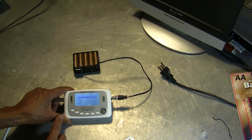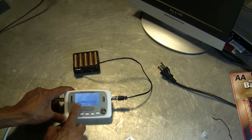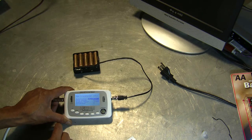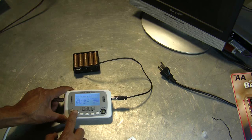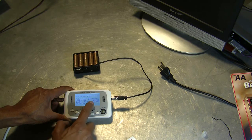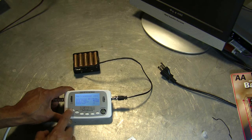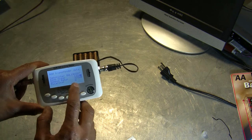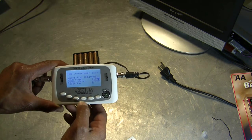Let's add a transponder. Arrow down until we go into 'Add Transponder' and press OK. Once you have located your satellite, arrow up or down and press OK — notice that it highlights a number and you scroll up or down. In this case, I want to program 11842. So I'll arrow right to the next digit, go down, arrow right again, then down again to put an 8, right again — 11842. I go down to 4, then right again, then 2. Now I have 11842 programmed on the screen, so I press OK.